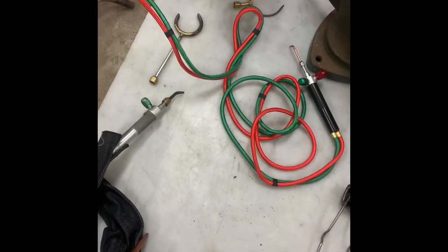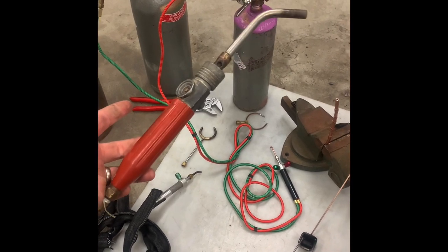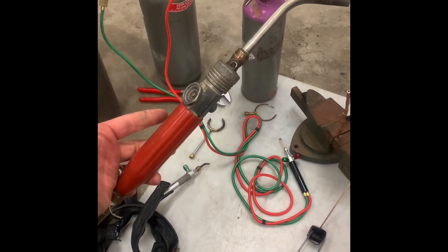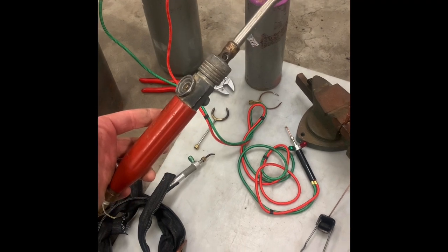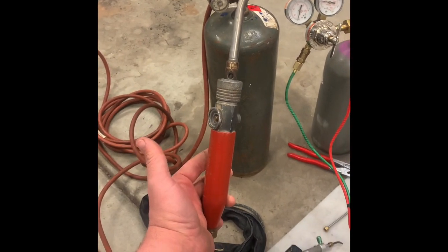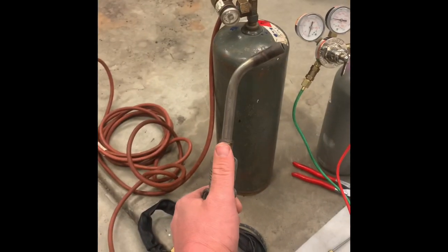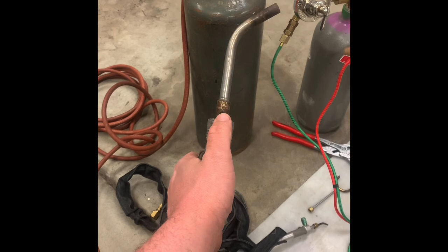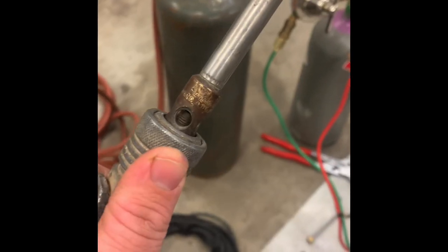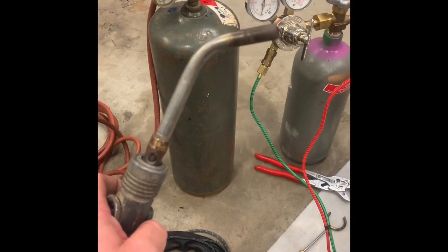And up from that, and that's oxyacetylene as well, and then up from that, is the torch I just got recently, another Facebook Marketplace find. This is a Turbotorch. This is a pretty old one, actually, but I paid $50 for the torch and the tank along with the regulators, so I can't complain. This only uses one tank, and draws acetylene through here, which has a little venturi, and the acetylene blowing through this draws air in, which is how it gets oxygen.